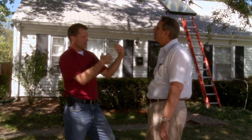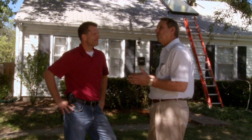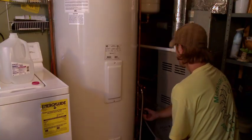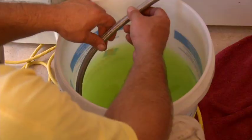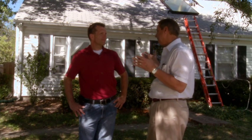A good concern is freezing, because during winter weather that's an issue. We have a closed loop going through the collector, and inside the hot water tank is where your domestic hot water is — the closed loop never comes in contact with that water. Inside the closed loop is a 50/50 mixture: 50 percent food-grade glycol and 50 percent water. With 50 percent glycol acting as antifreeze, it can go down to minus 20 degrees without freezing. The glycol also helps prevent boiling in the collector during summer, when temperatures can reach 250 degrees — so it serves a dual purpose.